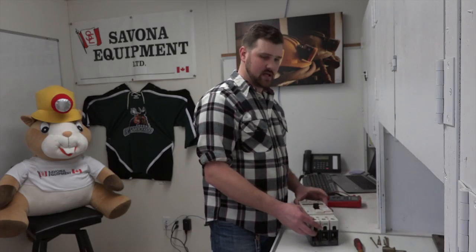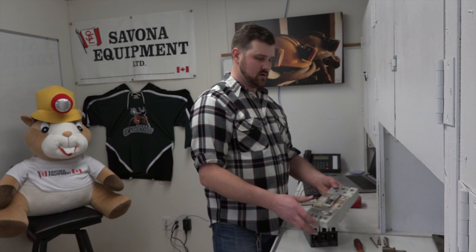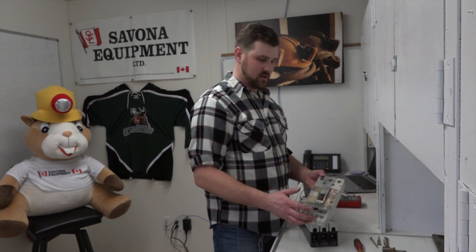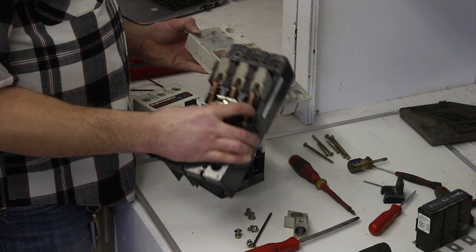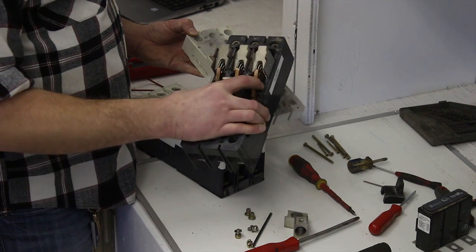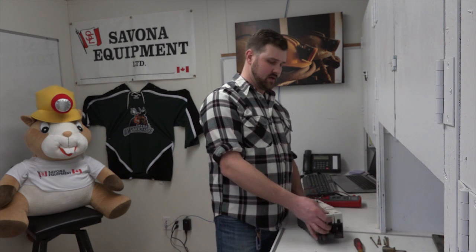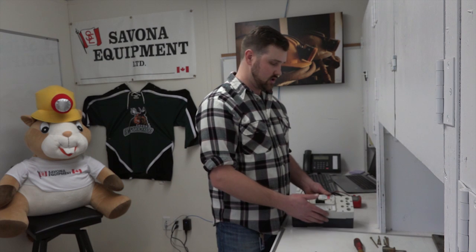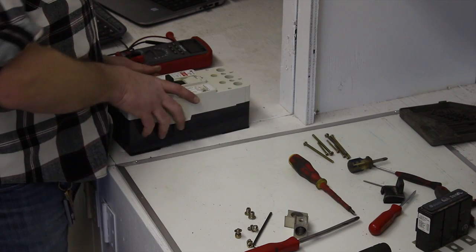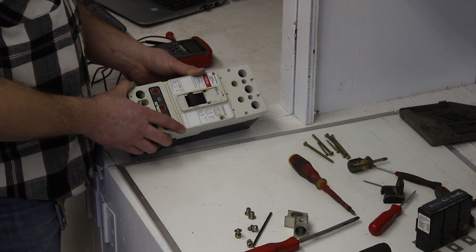The reason we're doing this today: we have an old breaker with a cover that is no longer readable or legible. The inside of this breaker is still in good condition — about 80 to 85% contact life remaining. We're taking one that is relatively new, but the contacts inside that specific breaker are no longer any good — they've been worn down.